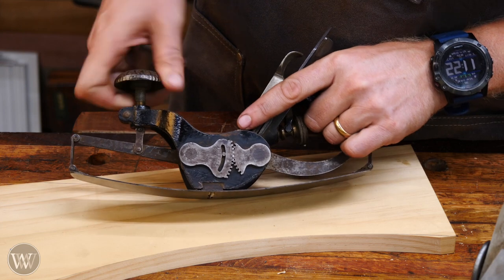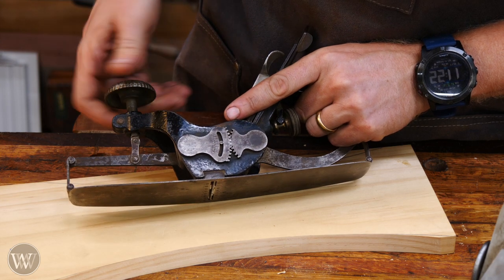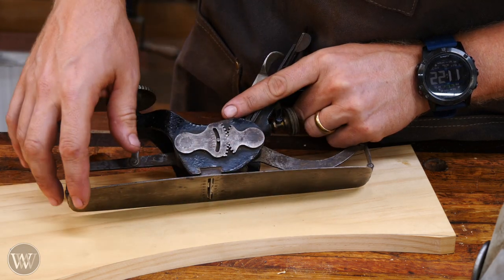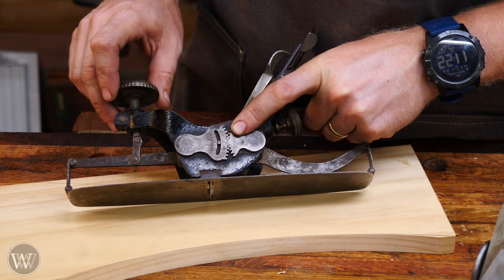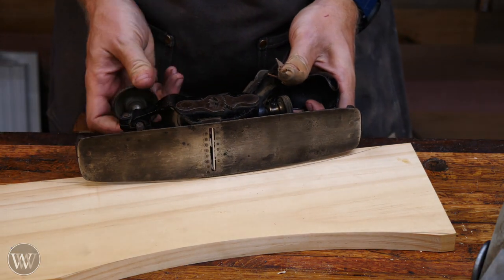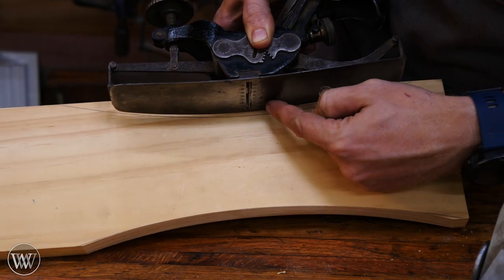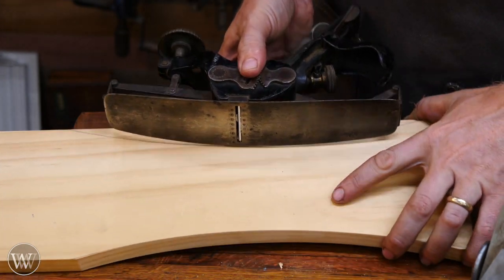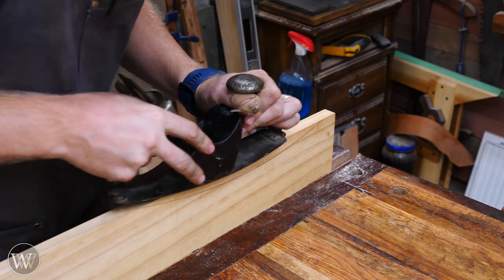The interesting feature on this one is the angle you want to put on there. There is a marking of 1, 2, 3, 4, all the way down to 0 that gives you a rough idea of where it should be — theoretically 0 is perfectly flat, though on this one it's off a little bit and there's some slop in the gears. So don't worry about those numbers so much. What we want to start with is putting it to the radius, making it a little bit flatter than our radius. If the heel and toe are touching, there's about a quarter inch right now between the mouth and the bottom — I want it to be about an eighth inch, so I'm going to make it a little bit tighter.